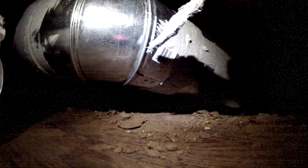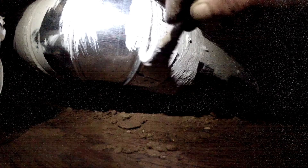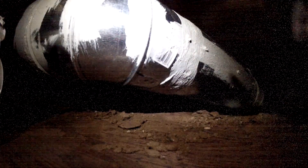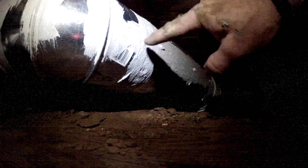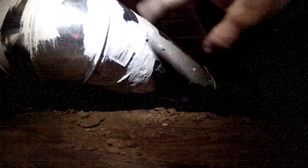These are 90-degree six-inch articulating elbows. Everywhere there's a turning point, everywhere there's a potential seam, go ahead and make sure they get mastic on them — good and thick, good coverage. Even though a piece looks sealed, you can still get an air leak through there. Mastic everywhere there is a seam, everywhere there's a screw, everywhere the pipes join together with either another pipe or a fitting, and anytime you have an articulating joint, mastic right there.